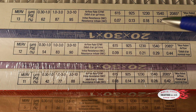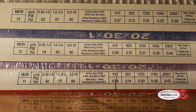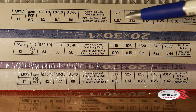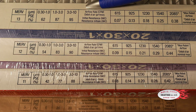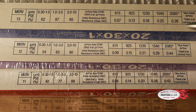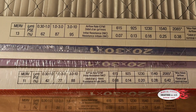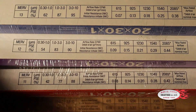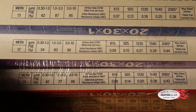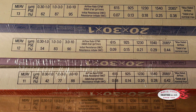As this filter gets dirty, the resistance will go up and the airflow will go down, and it will happen quickly on these types of filters because they're only one inch thick. This MERV 13 is grabbing all of these particles at a very high rate, but it doesn't have a lot of place to put them because it's only one inch thick. Even though it is pleated, that helps some. However, when they say 90 days on this filter, I would be very careful — on a three-ton unit, you're already up against the pressure we don't want to exceed.